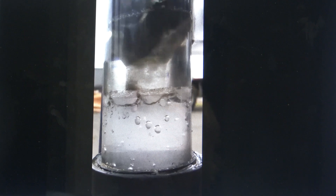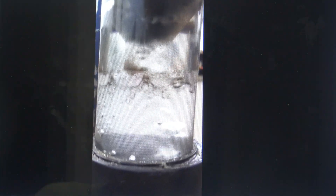Here's a situation where we ran into a lot of lead, and you can see it's basically trying to accumulate in the funnel. With all that big mass running around, you can see there's no sand in there — it's just the lead falling into the trap and then into the collection jar. This is the most dramatic — when you run into a big pocket of lead. You can see the trap funnel is just full of lead, dropping out just like nobody's business, while all the rocks and dirt are gone — the rocks stay in the trap. And then you can see in the jar, lead just continuously falling and collecting.